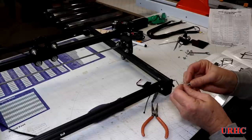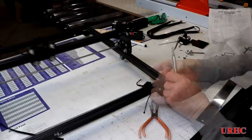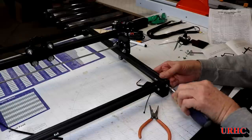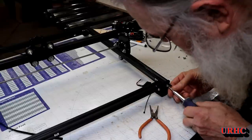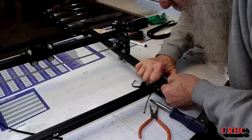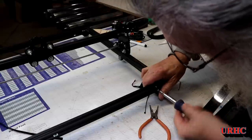This front side has the exact same foot as the back on this side, so same thing — put the timing belt through and start the screws. Then you go back and tension the belt. You want absolutely no play in that belt when you're done. The screw with the washer goes in the corner — start it loosely, then pull on the belt as hard as you can. It was kind of hard to grab, but once you get it, really pull so it stretches like a rubber band, then tighten that screw down.